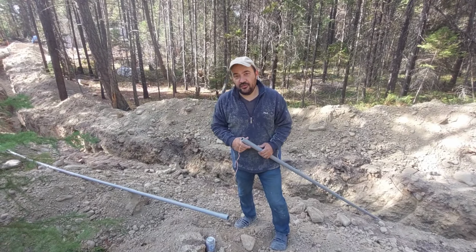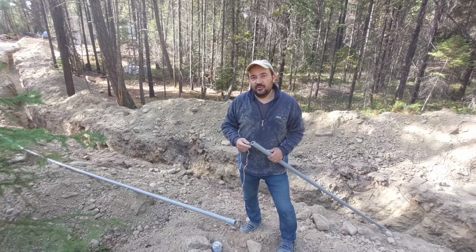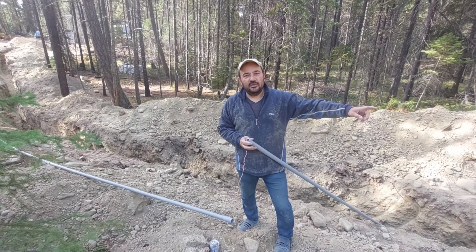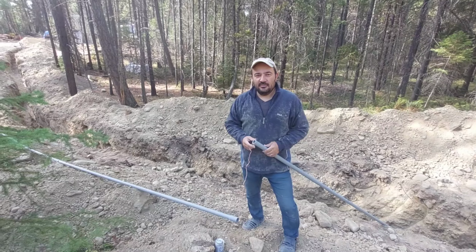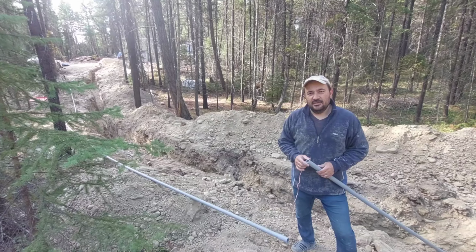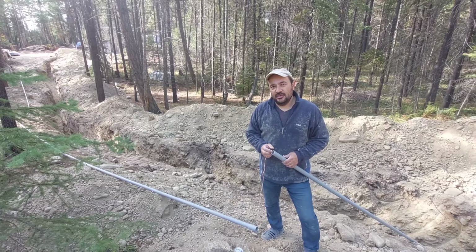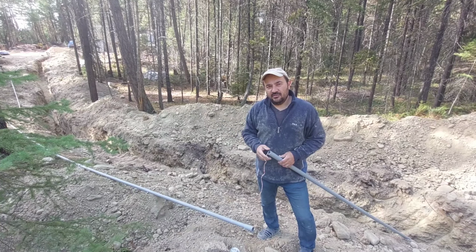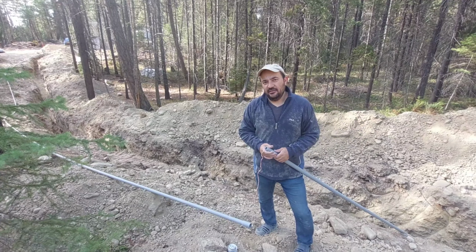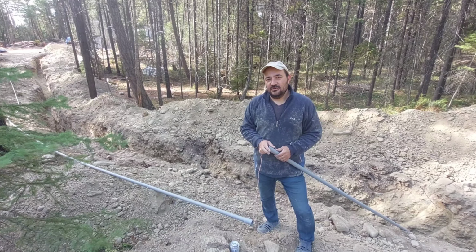So the professionals are not doing what I'm doing with this one. They just put a pipe in and then they put what they call a butterfly on one end, and they blow it and it goes all the way back to the other end. But because it's so long, I'm not going to risk it, so I better take my time and do it every 10 feet section and be sure that it's inside, rather than putting this one in the ground and then discovering I cannot do it because there's not enough force on the butterfly, not enough blow that can actually go all the way up to the other side. And I'm not going to try it, so I'm going to do it this way, and it's the same result, it just takes a little bit longer.